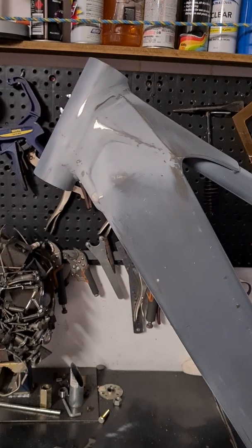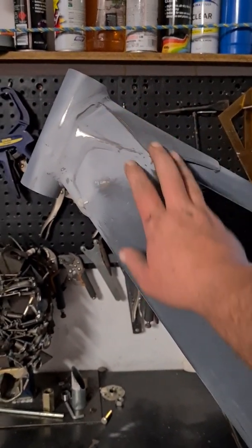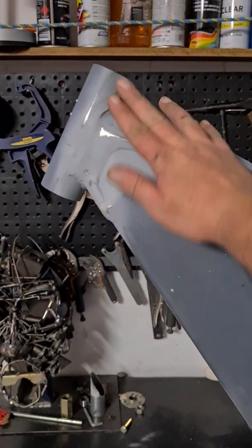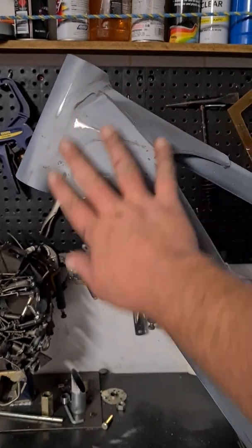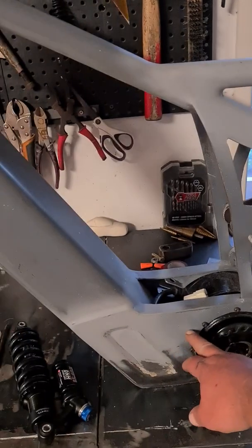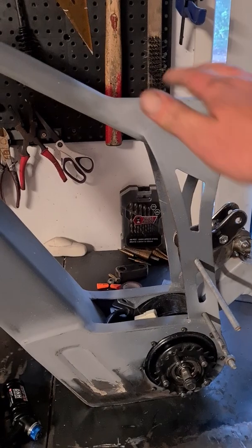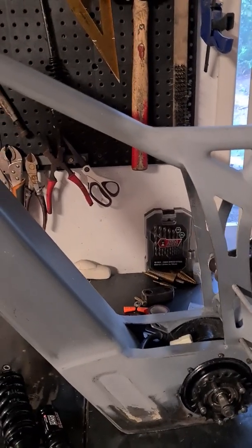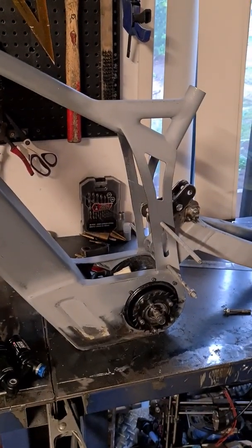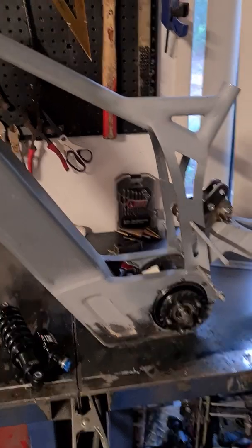In revision B, this will be a little bit different — I'll have this section laser cut and folded in one piece. This is currently made of multiple pieces, and similarly these sections on both sides will be laser cut as one piece to remove a few of the welds that don't need to be there. The less welding, the quicker and cheaper it is to make.